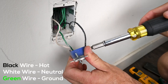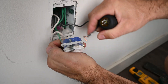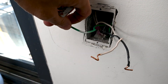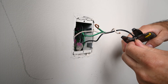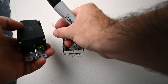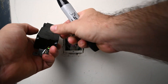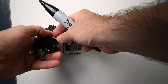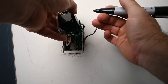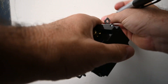We're going to unhook these wires. I'm going to clean these up a little bit. I'm going to strip the wire to 15 millimeters. There is a little strip gauge on the back of this outlet — it's kind of hard to see — so I'm just going to mark approximately where it's at. I'm going to do the same for the green and the same for the black.